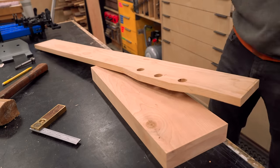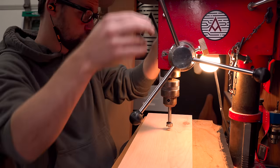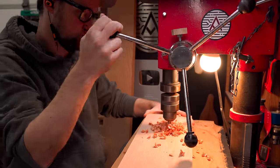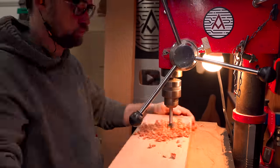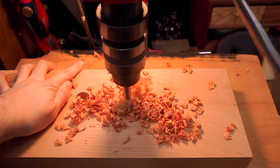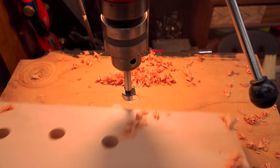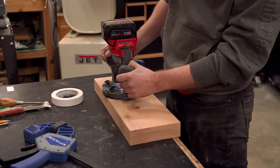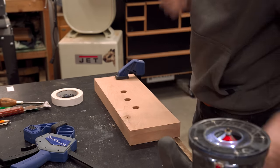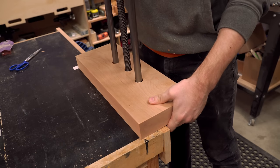Using the sideboard and the drill bit I used to drill it out, I marked the holes in the jaw and then brought that over to the drill press to drill that piece out. I knew I'd have to test the fit several times so I decided to chamfer the inside of the holes just to protect the grain so it doesn't accidentally tear out, and then I can check to see how things are lining up.